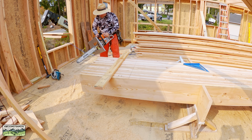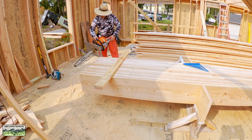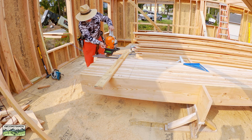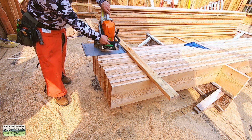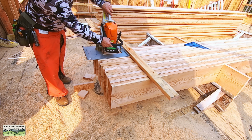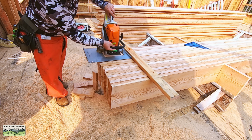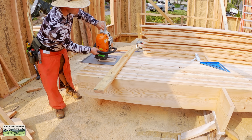Okay, it might look like more of the same, but now this batch of rafters is going to sit in hangers, but I ordered them the same length as the rafter stock with tails. Now here's why: I can set up the guide, very quickly cut these 20 rafters, whatever it was, instead of making them all flush, which can take longer than cutting. Set up the guide nice and square across the material and make one cut coming across.